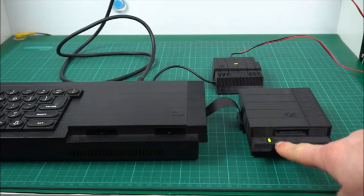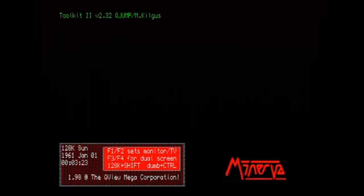And yep, it's working. We see the little green light. When you first connect the V drive, nothing different happens. It's initially mapped to microdrive 3. And if you try to access it without the SD card inside, you see some files. That's what it needs to bootstrap and become usable. For now, let's load it with LRUN MDV3 boot.